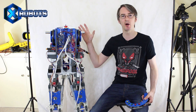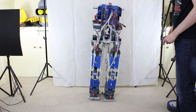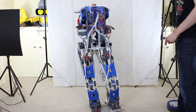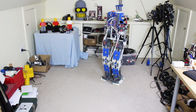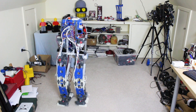This week we're going to build some proper arms for the robot so we can build more refined robotic characters. In terms of the walking development since the last Bender video, I've been spending quite a lot of time trying to make it stay over one foot for longer, by driving it actively side to side rather than relying on it just falling in that direction when it picks its feet up. Slow steps are around 800 milliseconds between steps, and fast steps about 400 milliseconds. I'll be doing more development on the walking as the series goes on, and when it works well I'll publish all the CAD and code in one in-depth technical episode.